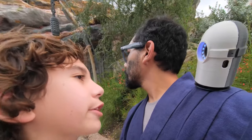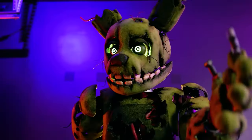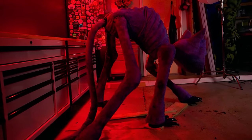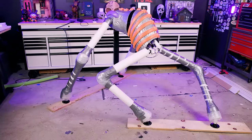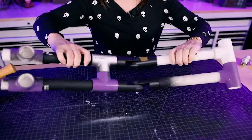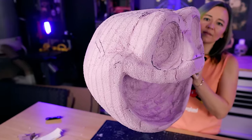It's a cool trick, especially for animatronics and cosplay props where you want to add a dash of convincing robot autonomy. But whatever you do, let's keep this technology away from Jamie and Jay at Wicked Makers. The last thing we need is for animatronics like these to track our faces. This is the Catnap character from the game Poppy Playtime, and in typical Wicked Makers fashion they're going big with the design. The structure is mostly made from PVC pipe with some custom 3D printed connectors that act as adjustable hinges. A compact wiper motor is set into the back to create this constant subtle arching movement.